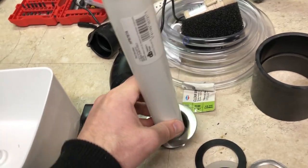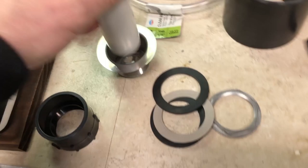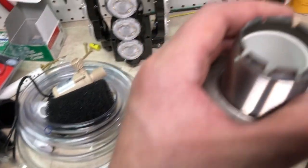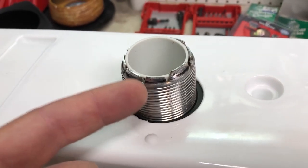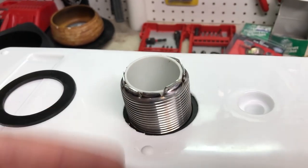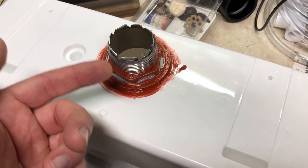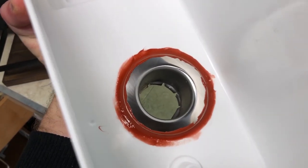That tube is going to extend through there and the pressure from the metal is going to hold the tube in place. Once we get the water level to where we want it in the container, we're going to cut that off to about where we want it and then put silicone around the outside so no water goes down past that. Now I have the bottom of the drain cut out. I basically used a Dremel tool and some tin snips and I flared the ends out just enough so we can put it over top of this 1.5 inch tubing and it will hold itself in place. As far as the sink drain goes, if you're going to use the same thing I'm using, you'll need to buy an extra rubber washer — this is for a tub drain, inner diameter 1 and 3/4 inch — that will fit right over top and it will sandwich together just like a bulkhead. I also recommend using a little silicone before you put that washer on just to make sure it's sealed really well. I have the drain attached now and siliconed the heck out of it — I did the outside as well as the inside. These are things you're not going to see anyway, so it doesn't have to look pretty.